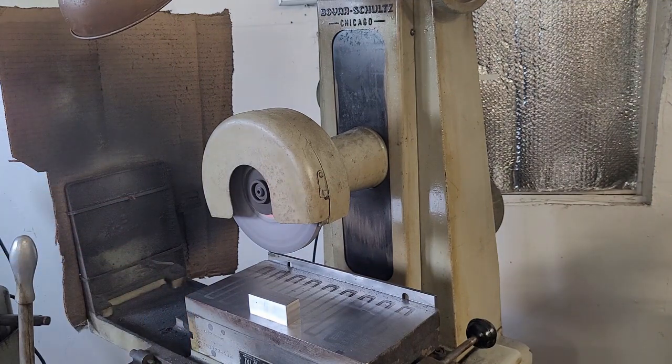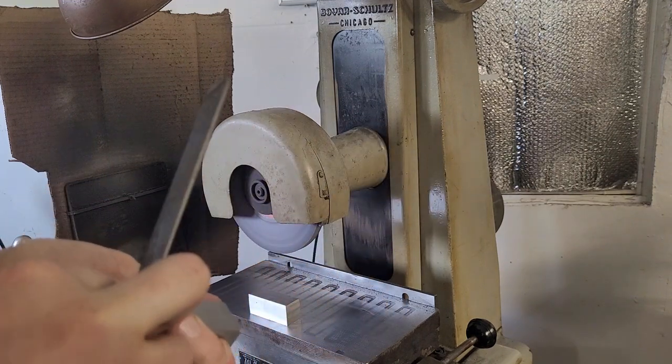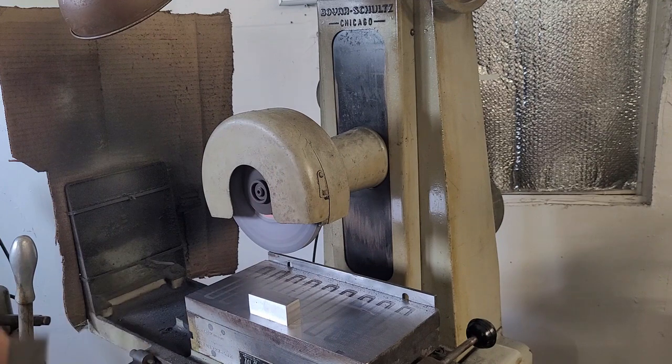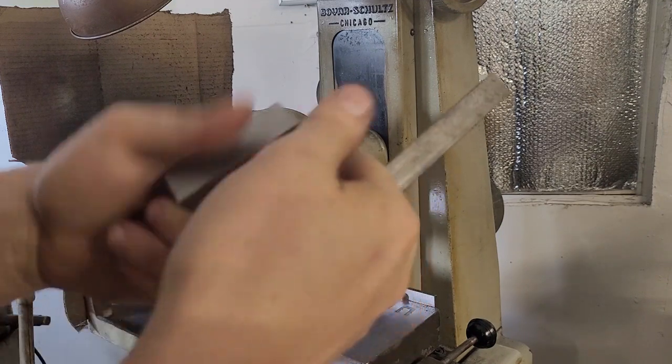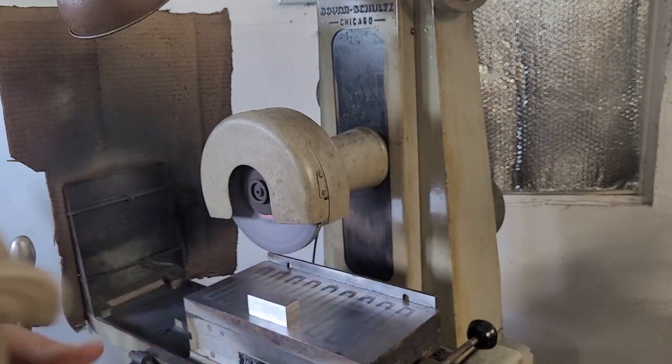So I just put one of the blocks on there, and I wiped the other one off. It didn't feel right going on the plate, mag chuck, so yeah, you see I cut a burr there. If you're not sure, keep cleaning. So you just knock them off with the file. Doesn't need to be complicated.